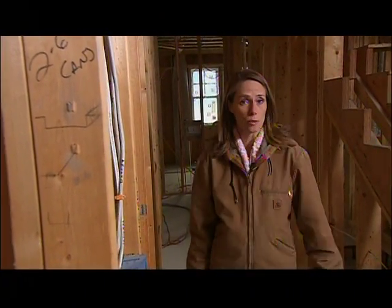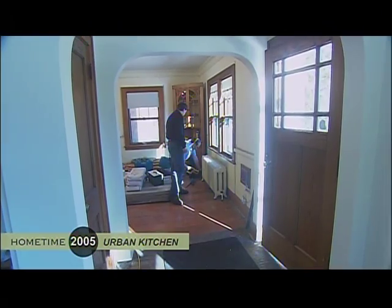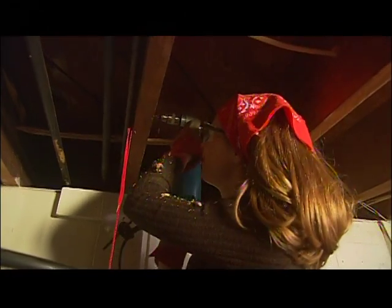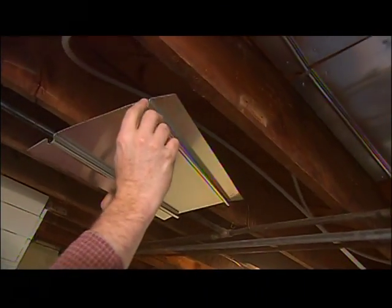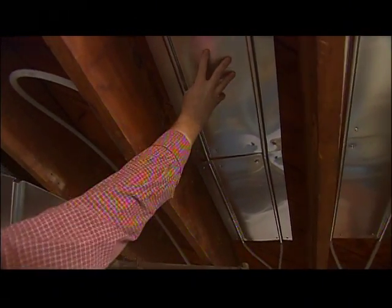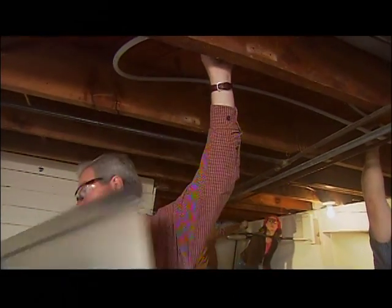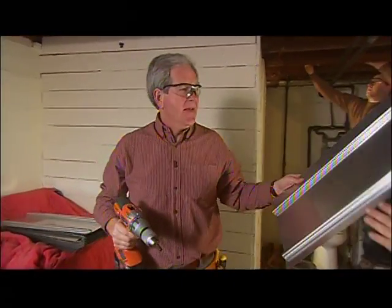There are other ways to anchor radiant floor tubing. One approach, used during a remodel where there wasn't a lot of space and old radiators were being removed, was to attach the tubing from the basement below. It's a retrofit radiant floor heating system using the same PEX pipe. Metal pans are used — you pop the PEX pipe into the little tube slots, then screw the pan up to the ceiling. A lot of insulation goes in that space to make sure the heat heads up to the floor above and not down to the lower level. The tubing installation is something most homeowners can do themselves, but hooking it up to the boiler is a whole other thing — that's why professional heating contractors are needed.